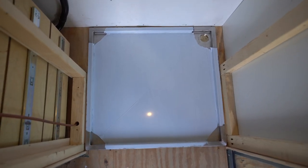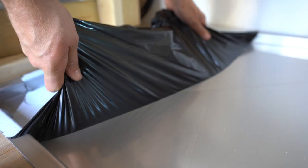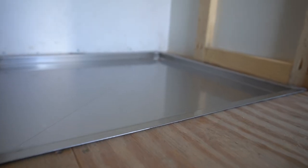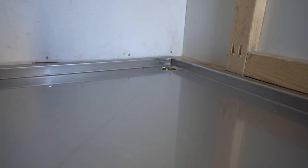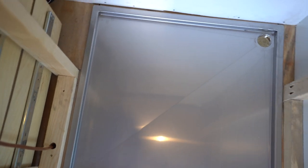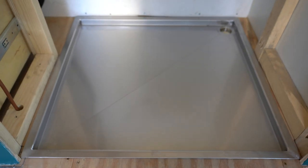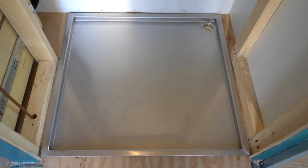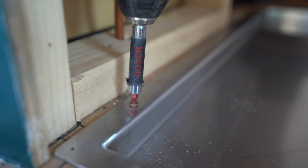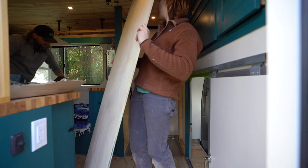Once the hole for the drain was in the right spot, the shower pan could fully set down into the stall and on the edges of our subfloor. That's a great moment when it sets in place and you get to tear off the cover on the stainless steel — it's so shiny and new. They're just really, really nice looking. Next, we drilled holes and screwed the shower pan into the floor. We feel comfortable screwing the shower pan down since the plywood walls will be installed over top of the lip and there's no chance for it to leak.